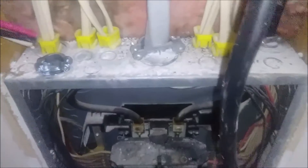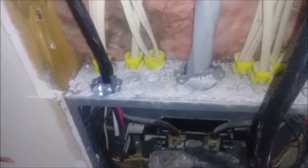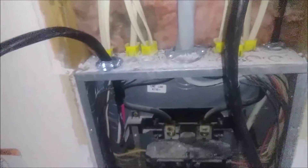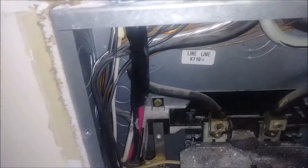I open the screws quite a lot and put this wire in. I'm holding the camera in one hand and putting the cable with the other — it's a bit tricky. I'm going to pull it and remember — I disconnected the main. The main has to be disconnected when you're doing stuff like that at home, otherwise it's very dangerous. Between the two buses there is 240 volts — maybe 200 amps — it can arc badly. So be careful.